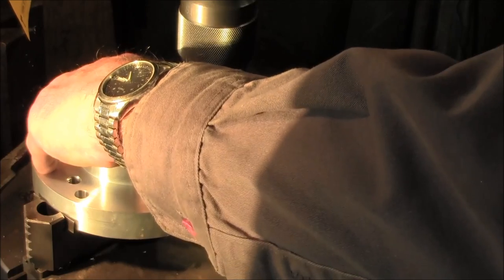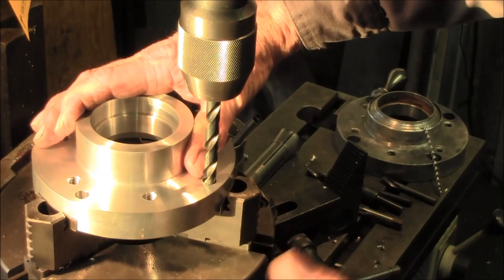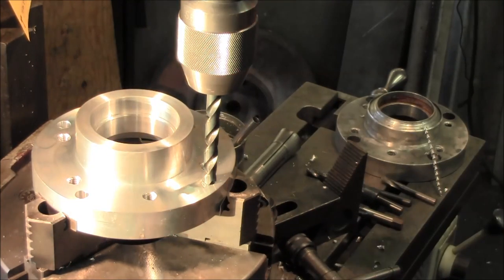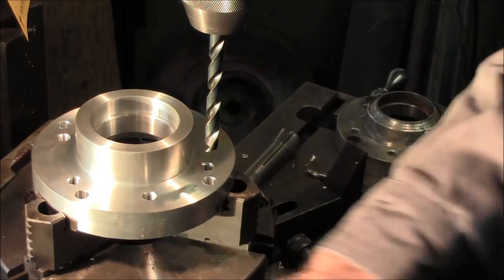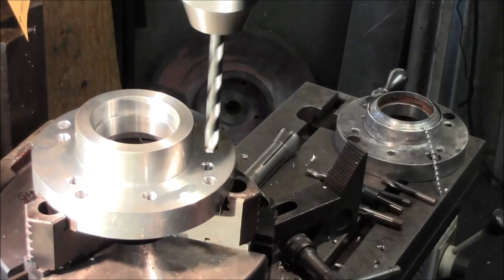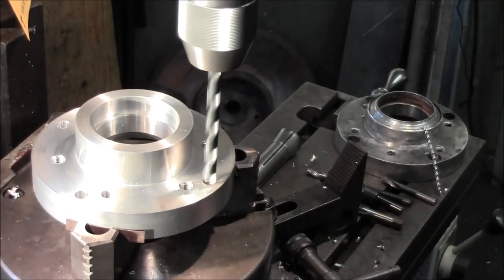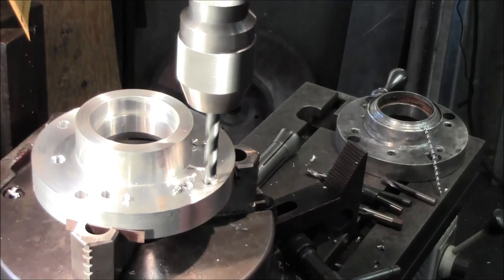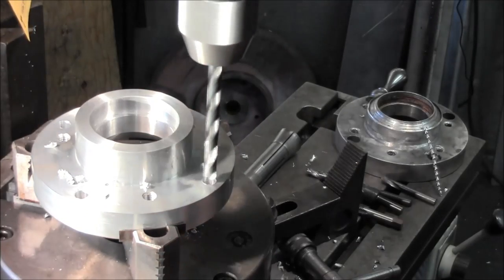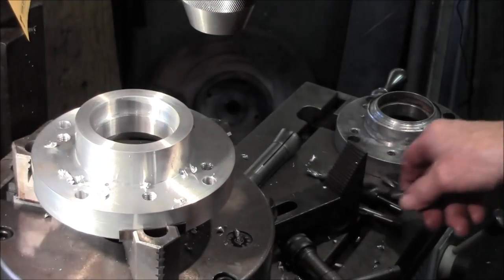Okay, drill bit down in. Okay, tightened up. Okay, now with this being 180, we should be able to go down through this one. Finish drilling it. Good. This one. Good. All right. Now let's go ahead and countersink the four tops here.